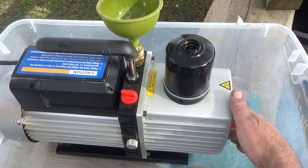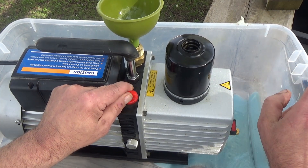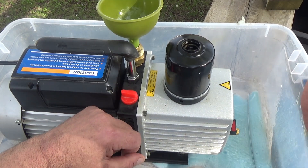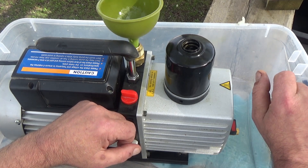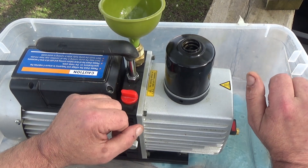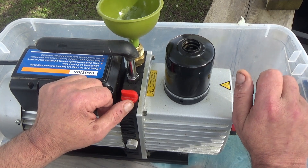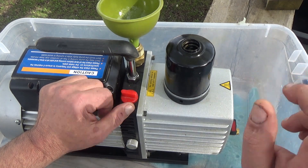So now I can turn that off, fill it back up with oil, connect it back up to my freeze dryer, and just see if that solves your problem. It did mine — almost instantly. I did a vacuum test on it and it got down to below 500 millitorr in five and a half minutes with an empty freeze dryer. I'm happy with that, it's working perfectly now. I've run two loads since then and I'm super happy. I hope this helps you — if it did, let me know. Thank you for watching, and I'll see you next time.